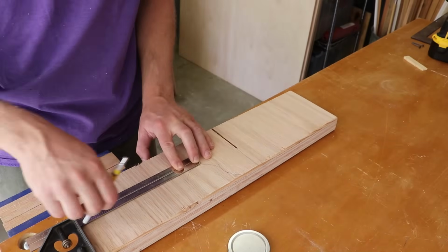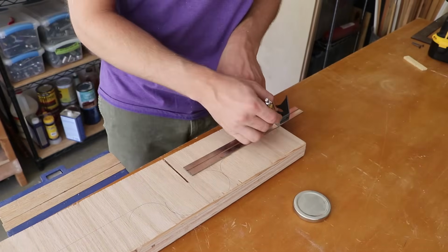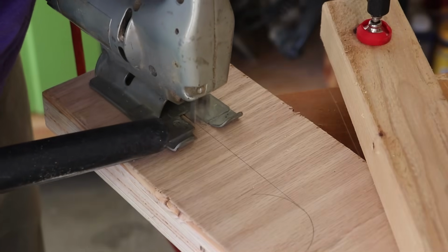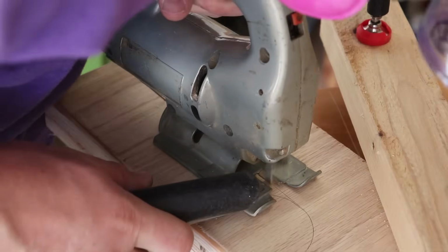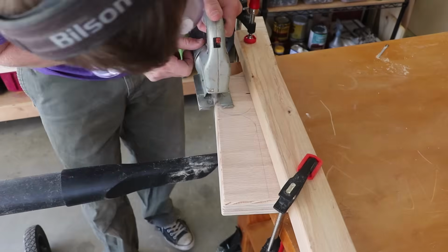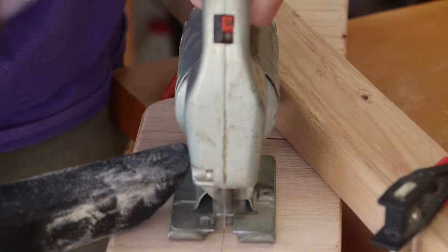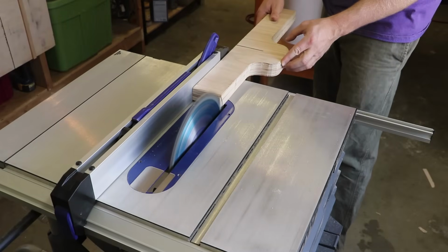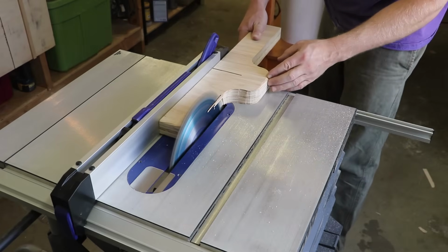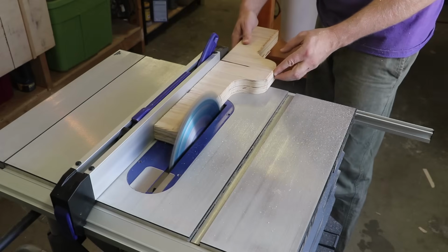I cannot lower the part of the fence where the saw passes through it, or I risk the structural integrity of the fence. I used a combination square and a jar lid to help draw the detail for this fence. It's good to think of both traditional and non-traditional methods of drawing. The table saw can be used to trim up the straight cuts with a non-through cut. A spindle sander and a belt sander would have been most useful in cleaning up the edges of the fence. I also trimmed the far fence down to lose some weight.